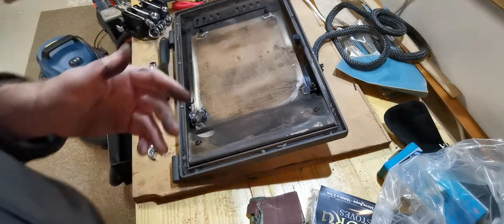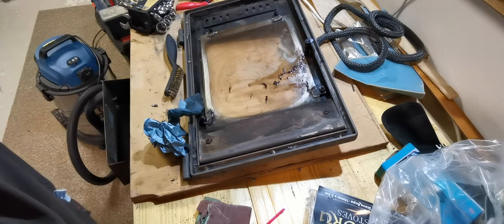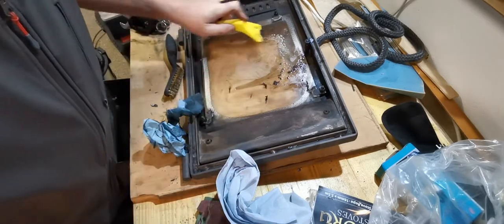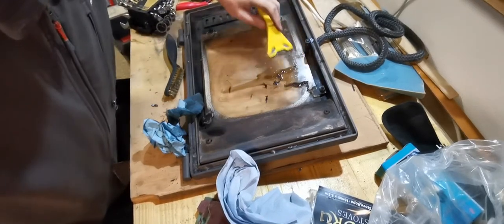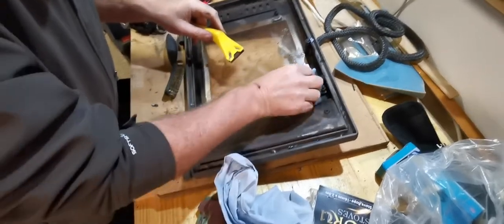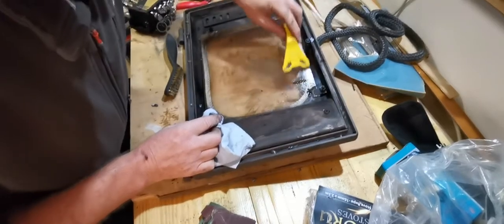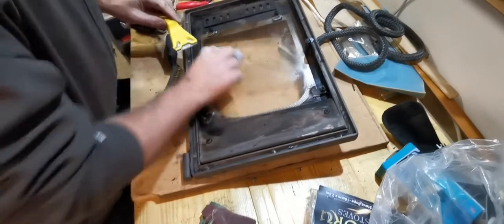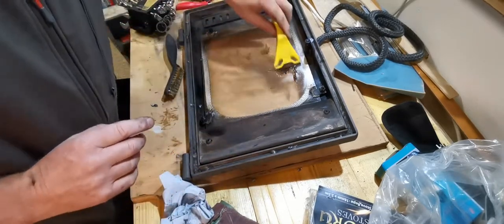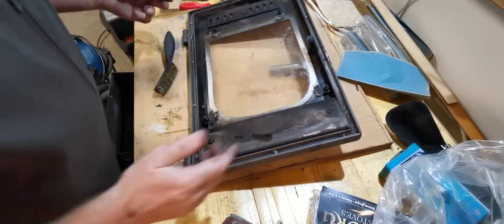I'll give this a bit of a last cleanup and then we start putting in the rope. While I'm at it I decided to clean the glass too - just spray some WD-40 on it and let it settle in, then use a paint scraper, being careful not to scratch the glass. The glass clears up actually quite well. The design redirects the flames against the glass which helps keep it clean. Pretty pleased with that - it's an unexpected bonus. I just set out to change the rope, look at me now!